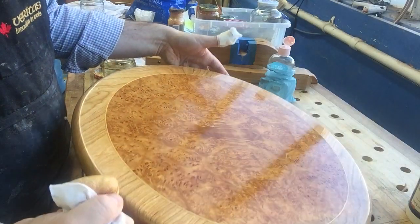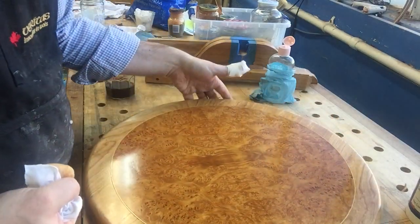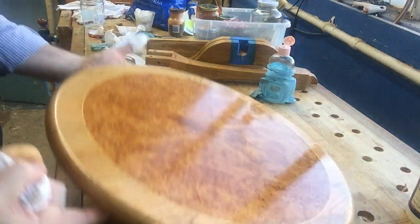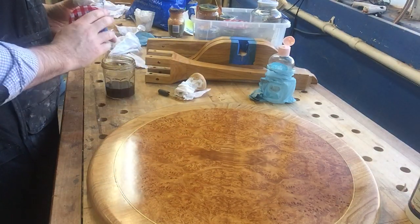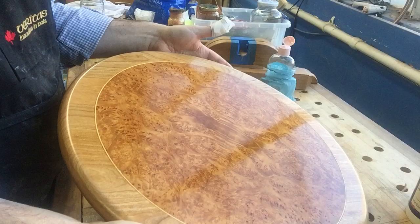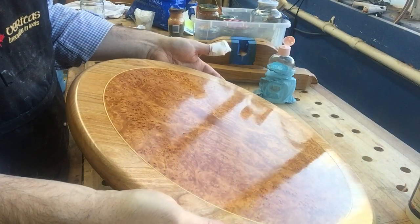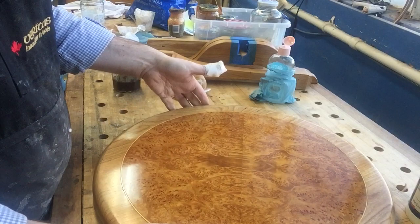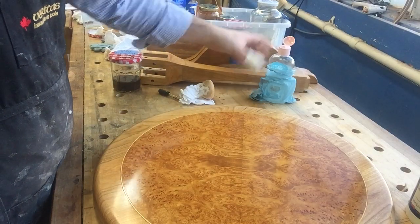There's the surface — very quick, simple, gorgeous finish. It's not glossy, it's just deep. I'm building the finish and have quite a good layer of shellac on there now. I'm going to let that set, come back tomorrow and finish it off. I'm concentrating on the veneer section because I want there to be a contrast in the finish between the solid outer and the bird's-eye maple. Orange shellac is used here — garnet will make it darker, and blonde will make it less dark. Thanks for watching.